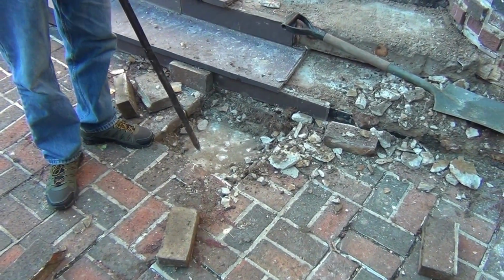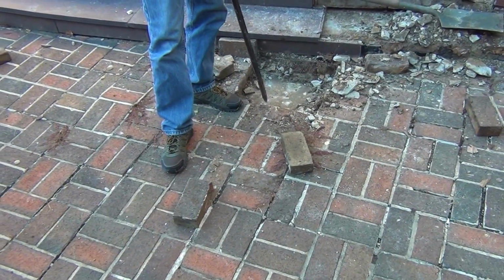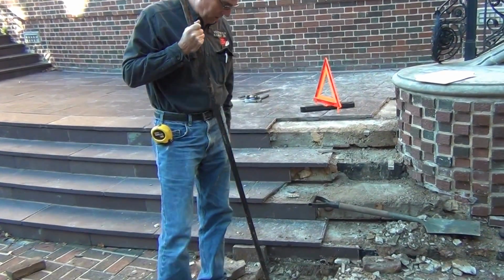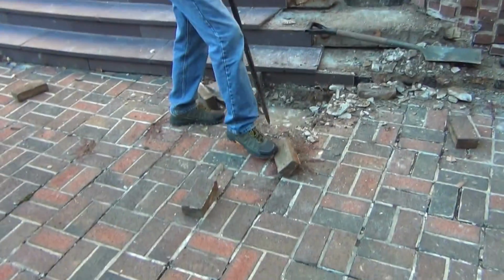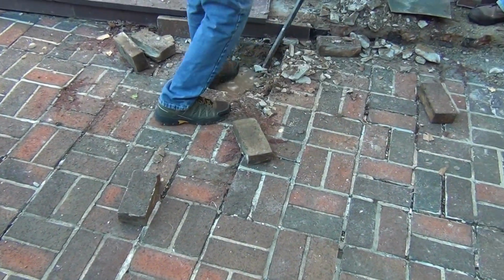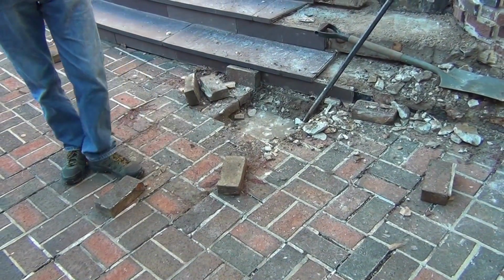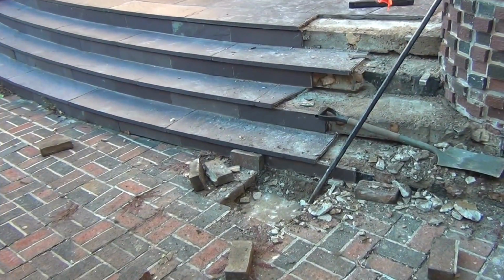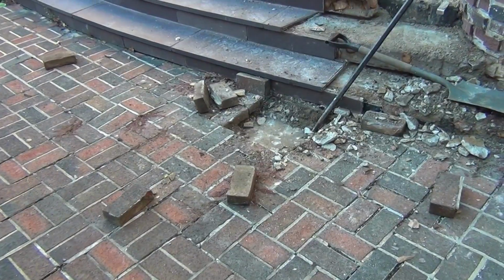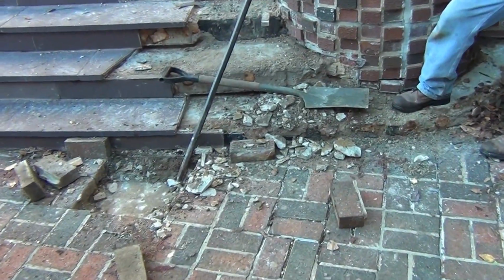But the thing is, if you're using this, depending on your material, it's going to tie you to this elevation. If we go with a 2.5 inch stone paver, and this is 2 1/4, my thought of lowering this surface then, you've got almost 4 inches, 3 3/4, so an inch and a half bed joint. But we're stuck with the same fall level, no drainage slab, which is what's probably causing some of this problem. That's right, freeze-thaw and all this other.